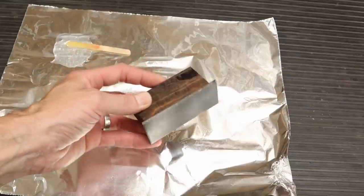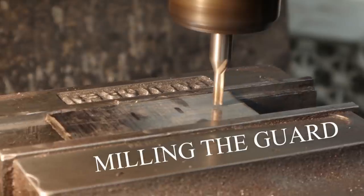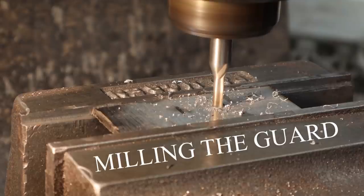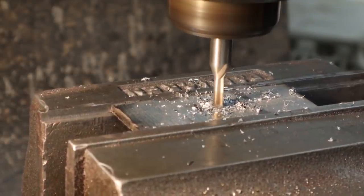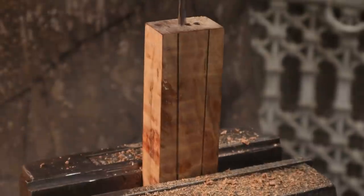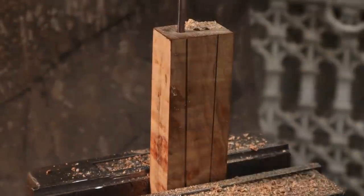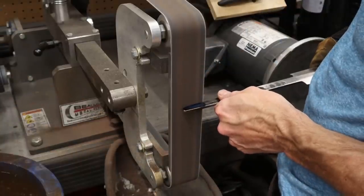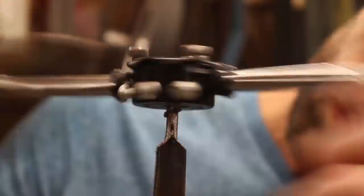Wire wheel the flats. Now we're looking at the guard material — let's go ahead and mill this slot. This is going to be the part that mates right up to the end of the sword. I use an end mill slightly smaller than the width of the sword and then hand-fit it to the sword itself. Then I'll drill out all of the material where the tang will sit inside the handle material. We need to create some threads for that pommel nut, so we're going to make a round tang and thread it.